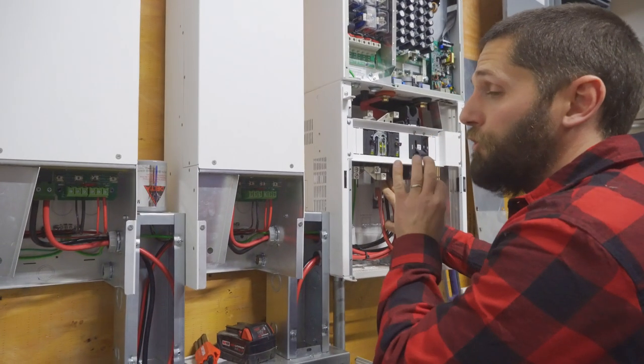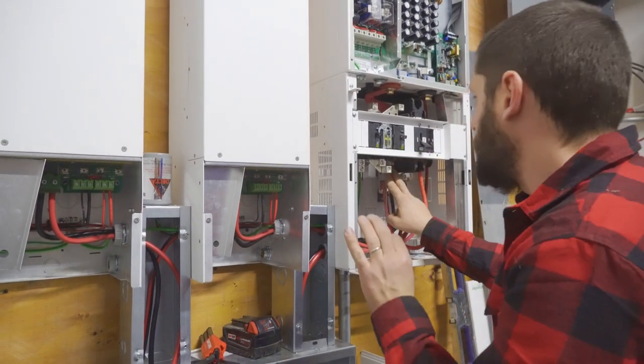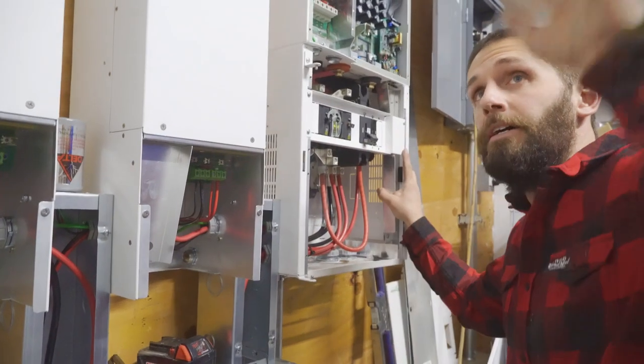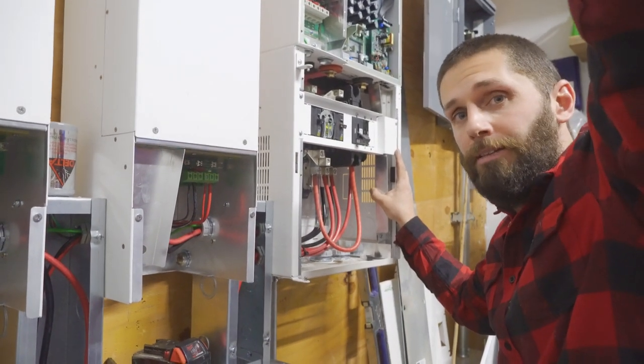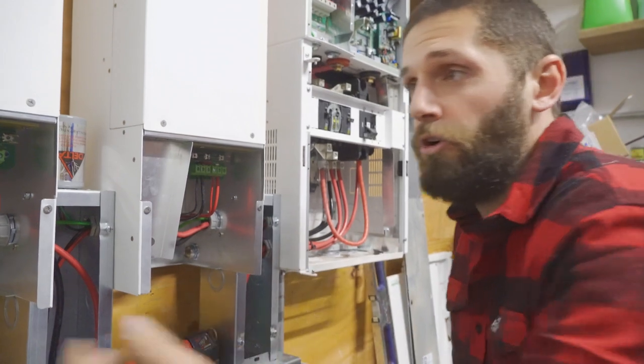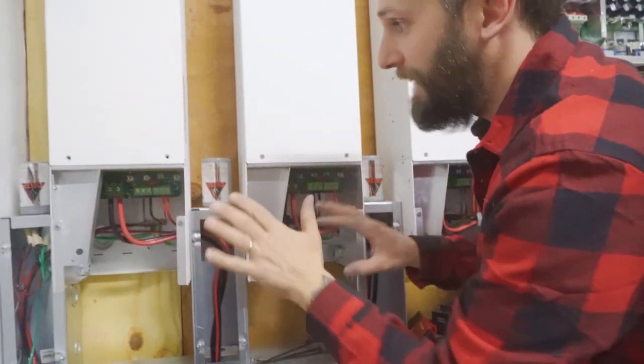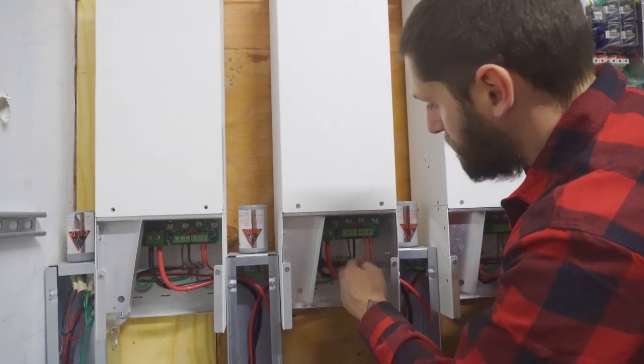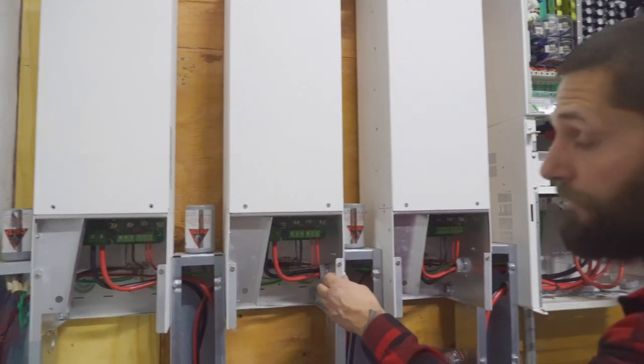That's just charge controller three is wired up that way only, because I don't have enough space for two more breakers in here. So we actually have a Midnight Solar box mounted right there. That goes to charge controller one and two. It's all the same exact thing, the way the panels come in and get wired up, but my negative comes off and goes directly to the inverter.